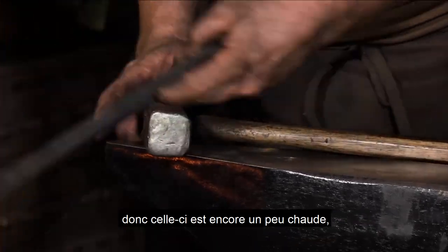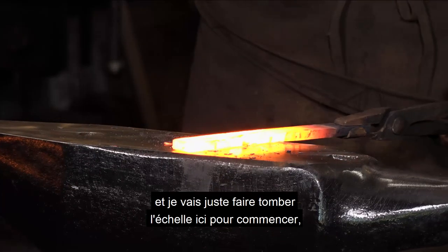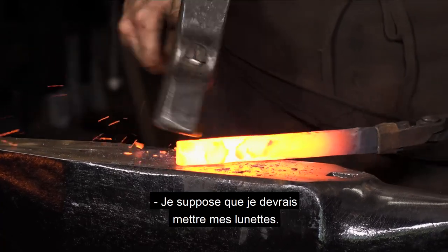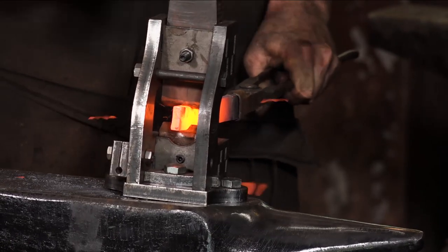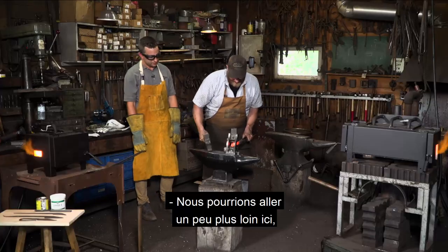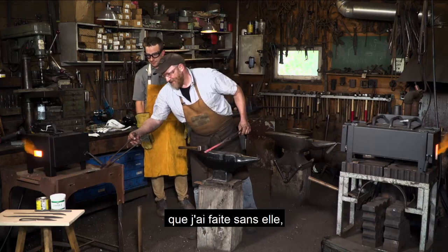This piece is still a little hot, but we're going to start with a piece of plain-jane steel from that spring and I'm just knocking off the scale here to start. Then we're going to isolate the handle. This is a little tool I made to help get the handle isolated. You can see we've necked it down and we'll slowly draw that out from there. You can do it without this tool — you just might not get as nice results.